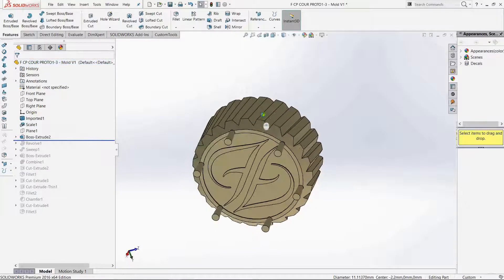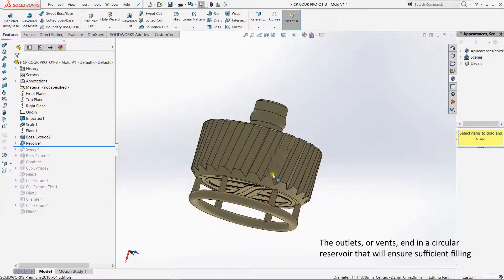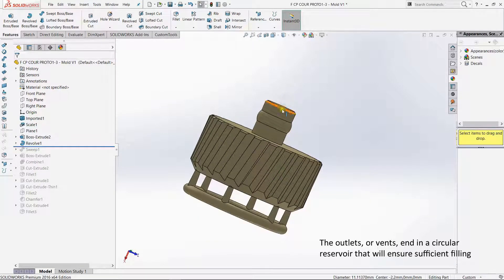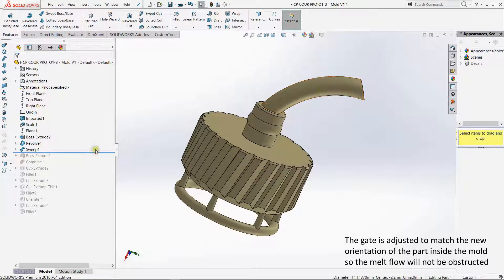In the bottom we're going to put some outlets to fit around the corner — we don't want to mess up the sigil in here. Then we're going to create a track around it. This part is pretty solid, so I want to make sure that the material doesn't just flow out through it and actually fills up this void. So I'm going to make a track that starts filling while this is also filling. Now I'll begin on the gating.